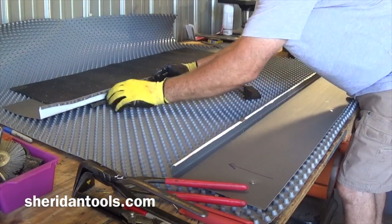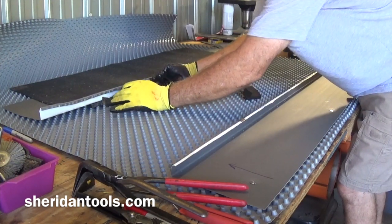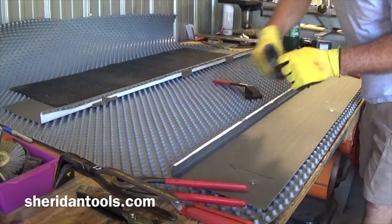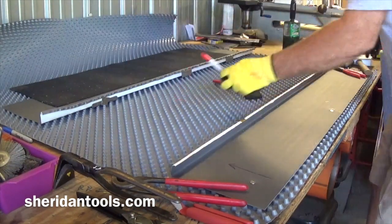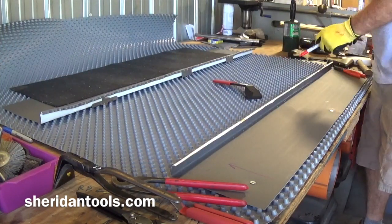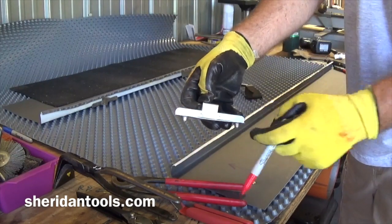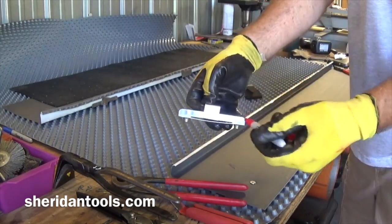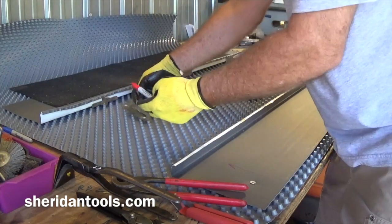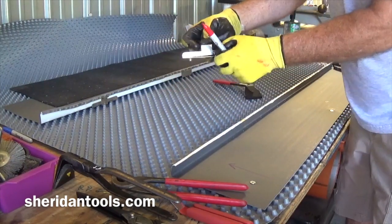This is a sliding clip, and sometimes when you're taking this apart, the sliding clip will get shifted out of place. If it's a sliding clip, it actually wants to sit in the middle, in between these two dots, for maximum expansion potential. So if you pick this up and look at it and the clip is jammed on one side or the other, then just reset that in the center. Okay.